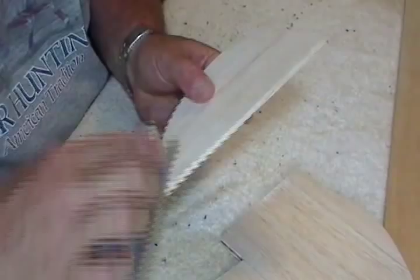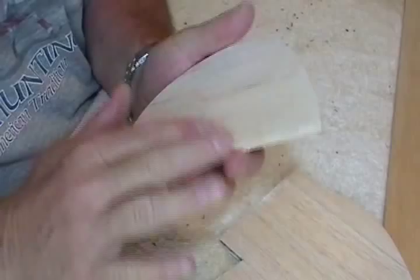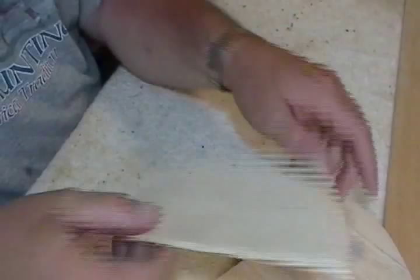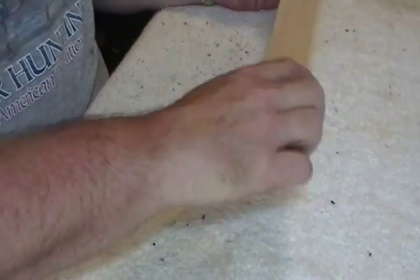But okay. Always sand with the grain, the direction the grain's running. If you sand crossways, it's going to leave more sand marks. It'll show up worse. But if you do it with the grain, it won't show up. And, all right, we've got that all good and smooth. We'll lay that aside. The aileron, I didn't see anything on those that needed fixed, so we're going to the wing now,